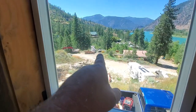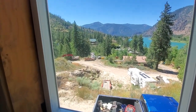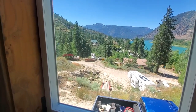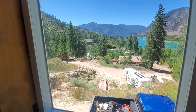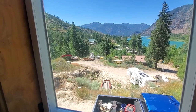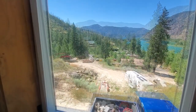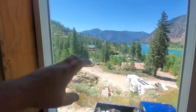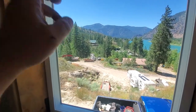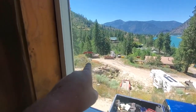The bucket truck was really giving us trouble. It was just shutting off after 30, 45 seconds sometimes, one after another after another. We're going to bypass all of the controls. It's got a whole mess of controls where you can start it and stop it from the bucket. It's got old generator controls and stuff. We're going to bypass that, wire it the same.